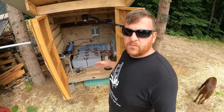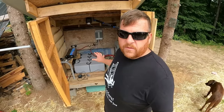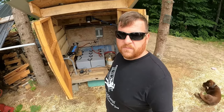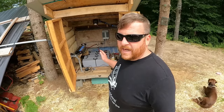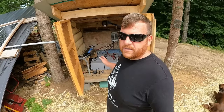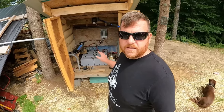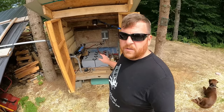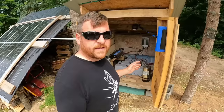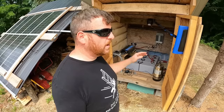I just looked at them in case we wanted to add a few more batteries — they're $200 apiece now. Some of you might ask why go with old technology instead of LiFePO4 or lithium iron phosphate batteries. Our cabin here in northern Michigan gets down into the single digits and below zero degrees Fahrenheit quite often. These AGM batteries, as long as they're adequately charged, won't freeze until negative 50 to negative 75 degrees Fahrenheit. They do work less efficiently in the cold, but lithium iron phosphate cannot charge when below freezing.